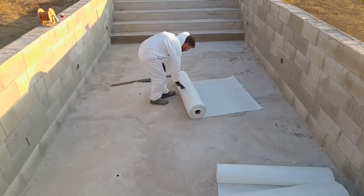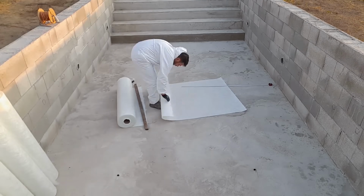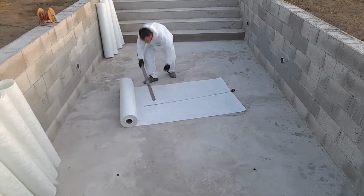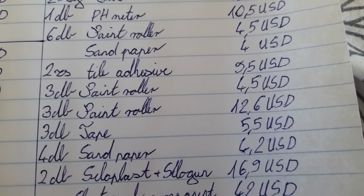I used a polyester-based synthetic resin with 500 grams per square meter glass fabric. I had to do this whole process during the night because the resin will set under the heat of the sun. I got to this part during the summer, but maybe in any other season it will be okay to do this during the day.